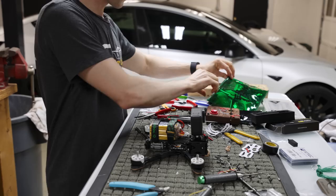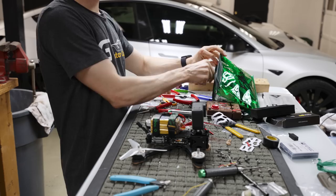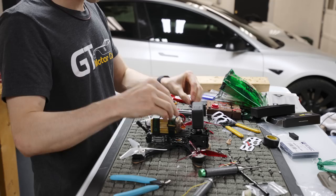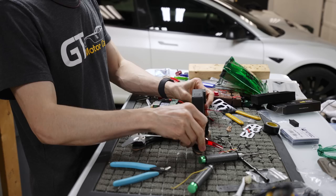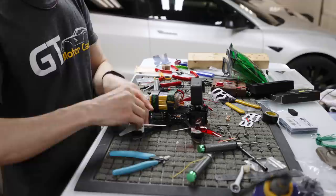I'm gonna recommend that people fly the P4 for this particular setup, which is this candy cane prop. All of our ETHiX props are designed with a two-tone color scheme in mind, except for the S5, which is our quote-unquote cinema prop, 5-inch prop. These are 5.1 inch props, and these are a mild pitch. The P3, which is our peanut butter and jelly prop, which is what I fly on my freestyle rigs, is a slightly lower pitch, but the same airfoil as this particular P. Obviously, you see P, P3, P4. Usually, the higher the number, the higher the pitch.